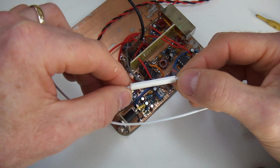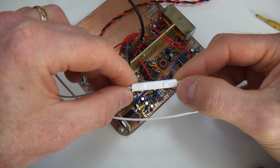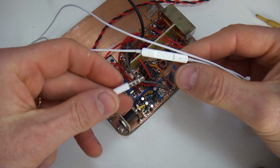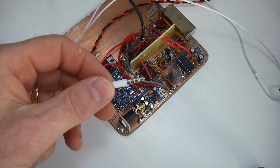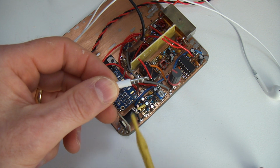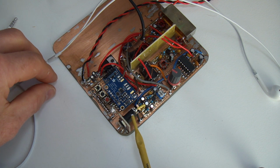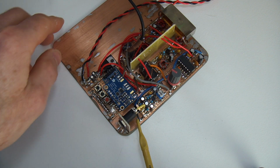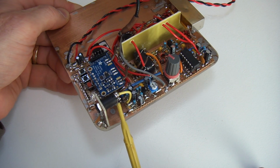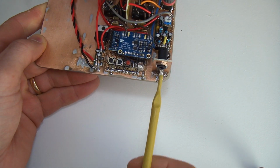What I could gather online, it looks like the biasing's around 0.5 milliamp at 2.2 volts, which I've just used 2 volts at 0.5 milliamp, which we'll look at in a sec. Anyway, that comes back through a four-way switch, where we have microphone, ground, and then left and right, or right or left, doesn't really matter, for the headphones, and that's what the connector down here is. This is good because in past builds I've had to have two connectors, one for the microphone and one for the headphones, and this one here is quite nice and compact now. I get away with just having one, and I've got that coming out the front, which is nice.